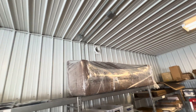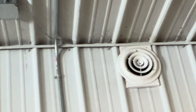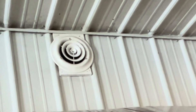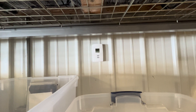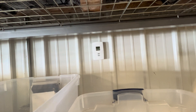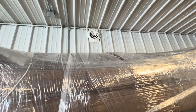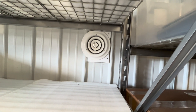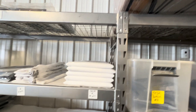Last time it was so cloudy the fan wasn't even running. If you listen really closely and look at the cobwebs on the ceiling, you can see the air moving. Essentially if you stuck your hand up there it would feel pretty similar to a hair dryer set on low. Our thermostat here says it's 43 degrees in here, which is pretty amazing. I actually set the thermostat all the way up to 80 degrees because it will never achieve that temperature and I want this fan to run as much as possible. There's the outlet from the solar unit, and down here we have the inlet which sucks the cold air out of the shop and draws it back into the air space between the panels.